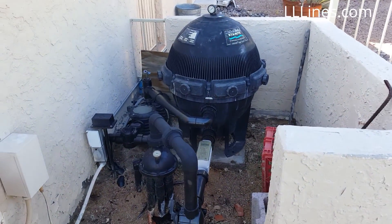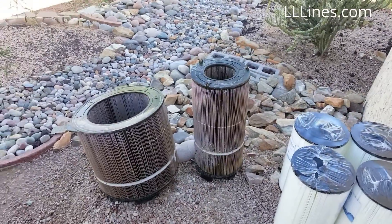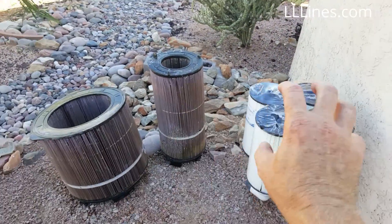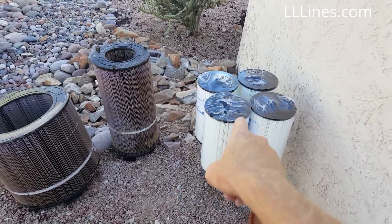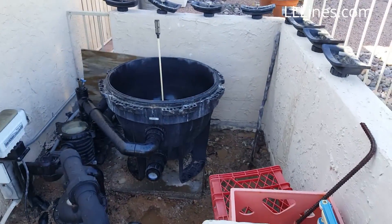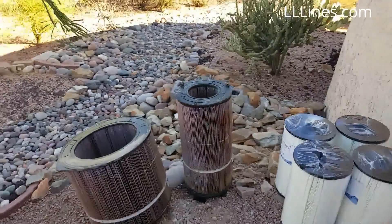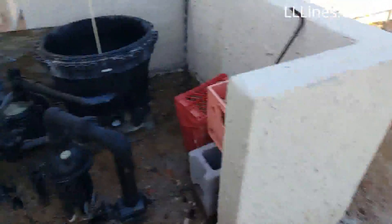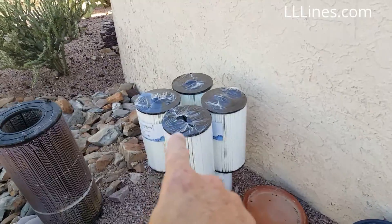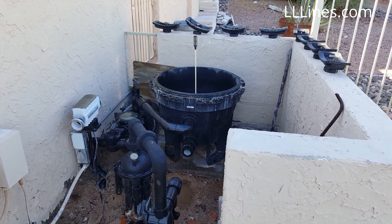Travis here with LNL Lines. We've got the S8 M150 filter cartridges out, so we're converting from those to the same filtration area using smaller cartridges — more manageable, better quality, better flow, better cleaning, more energy efficient. I was squeaking like a little girl pulling those things out because they can get heavy and you can't get your footing just right when you're leaning over. Anyway, we'll get these assembled in the old tank and take another shot at it.